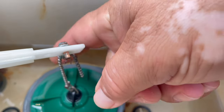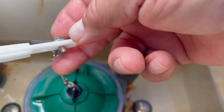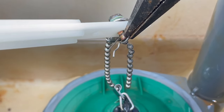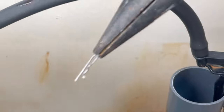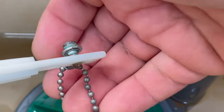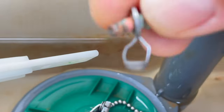To make it easier — this is your flush arm, and your flapper valve is attached to this clevis pin. Grab that tiny pin and remove it from the clevis pin — it's very small, so don't lose it, put it in a safe place. Then remove the clevis pin; it comes with the chain. Remove that too and put it in a safe place.